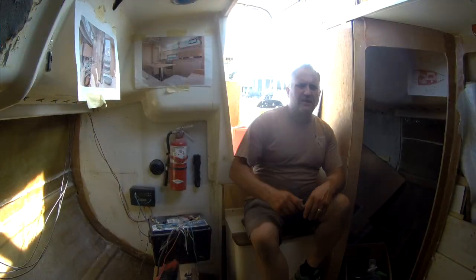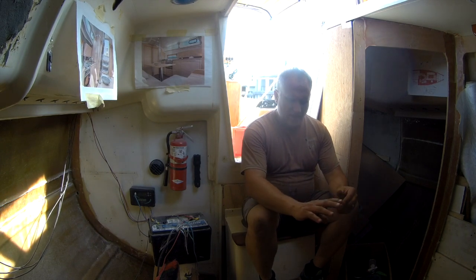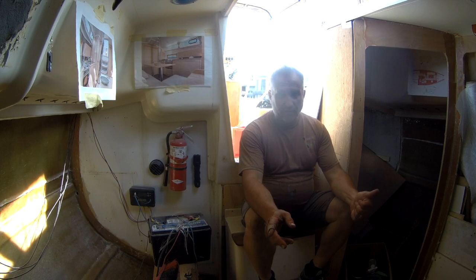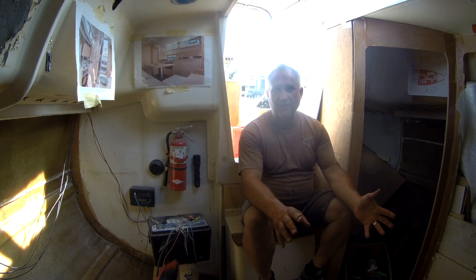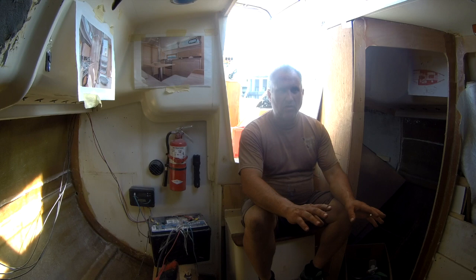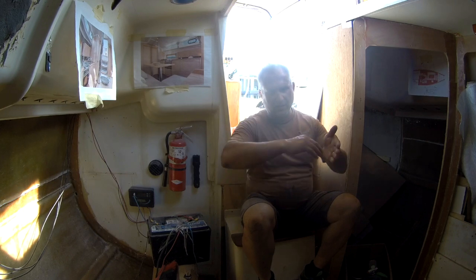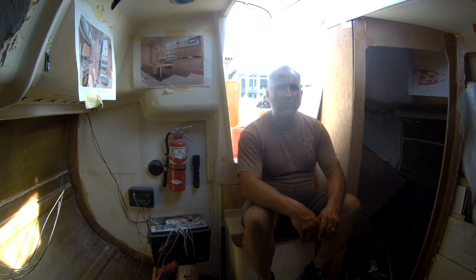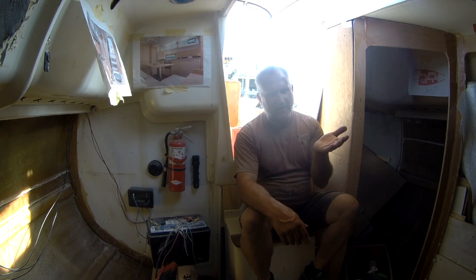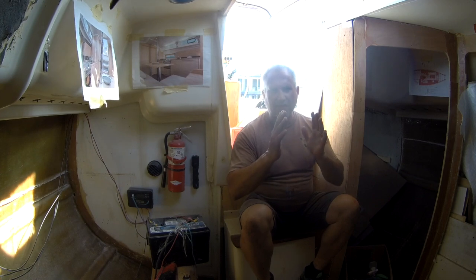Just an update — we had the failed launch in the sense that the boat leaked and my motor didn't work. So we pulled up on the sling. I was able to figure out what was wrong with the boat leaking. It was a very small crack in the bilge right at the keel join, and whoever — the gentleman that owned the boat before — cut into it with a grinder or something. So I had fixed one side, but I'm guessing that structurally...